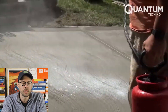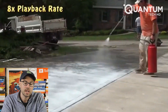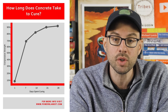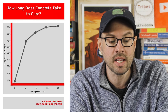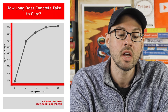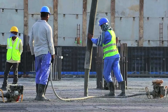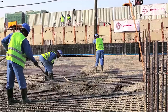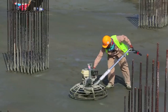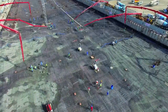Finally, the spray they're putting down is not paint — it's a curing compound. The curing compound prevents evaporation of moisture from the concrete. It actually takes 28 days for concrete to fully cure and reach its maximum strength, so you need to keep water in the concrete so it doesn't get dry and brittle. This is why curing concrete in hot desert environments is a nightmare — a concrete mixing truck keeps the mixture moving and cool. The lighter color of the compound also reflects heat and radiation to help the concrete cure.